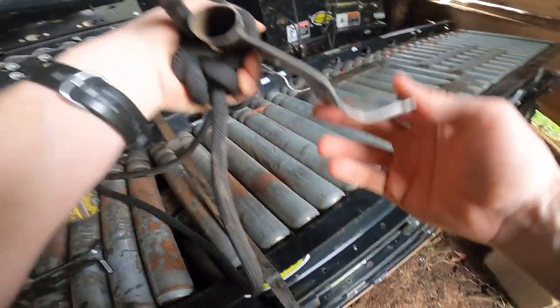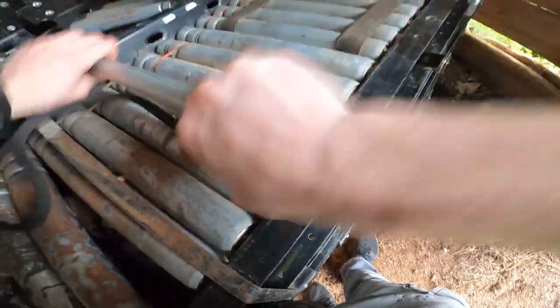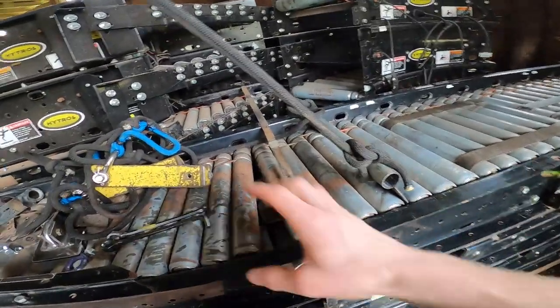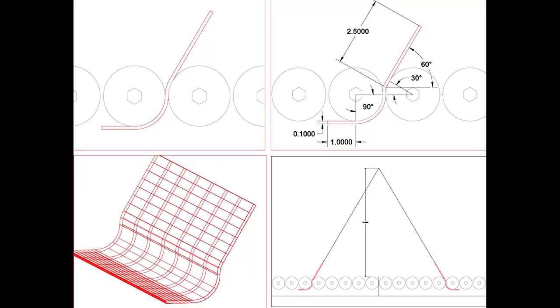Here's a neat option for rigging up conveyor that has rollers on two-inch centers. It pops down between the rollers, turns back 60 degrees, and then of course you have another one on the other side — and then you for sure capture the center of gravity on the bed so it holds it nice and level. Now that we've proven the concept, we'll see if a fabricator can make these bends.